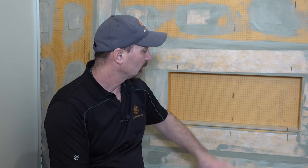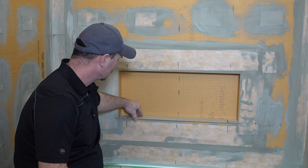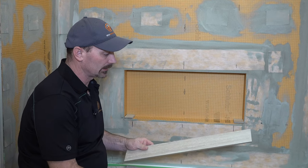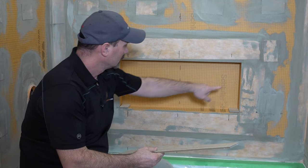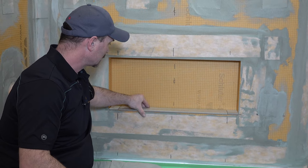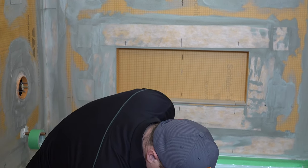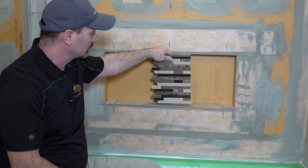Hi, I'm Shannon from HouseImprovements.com and in today's video I want to show you how to tile a shower niche. I've got a few of the things pre-cut that we're going to be using. We're using ceramic tile. The main tile on the walls are going to be 12x24s, so I'm using that product. For the border inside on the top, bottom and sides, just cut to the appropriate sizes I need, and then I'm going to be using a glass accent tile in the back of the niche itself.